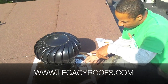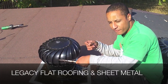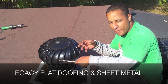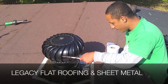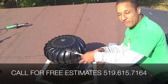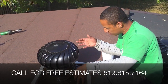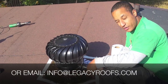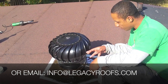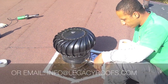And then just cover it with brown granulate. The good thing about this product is you can mold it to whatever you want — if you have a gas vent coming through your roof, a power electrical conduit running through it, or in this case an air vent. So you don't have to go buy certain vent flashings in different sizes. It's moldable right to the roof and to a certain detail, so it's great for this particular spot.